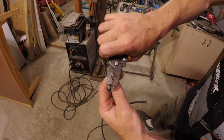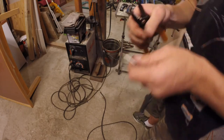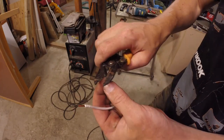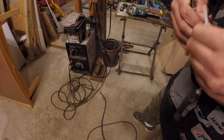This is about 14-gauge wire. If you get the right size gauge on your wire strippers, you shouldn't need to twist it. When you do twist it, you can accidentally cut strands of wire off.